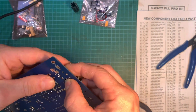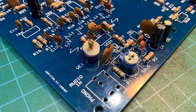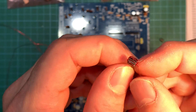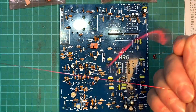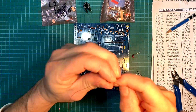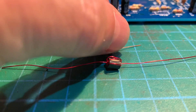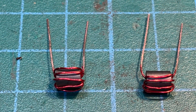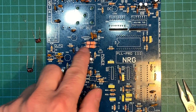So now we've got our little ferrite beads — they have five windings each. I've just done one and I've got to do the last one now. I have my ferrite bead and the SWG wire, so let's wind the last one. There we are — both ferrite beads wound with five windings each. I've already cleaned the legs up on one; still need to do the other one, otherwise the solder won't take. We've got ones that go in one location and ones that go in another.